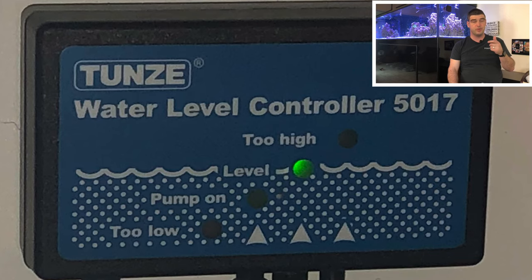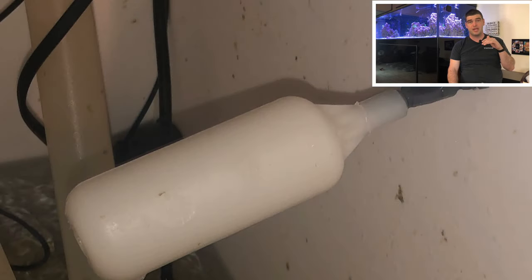I do use a manual float valve backup. This is absolutely a requirement in my opinion if you're going to hook your fish tank up to a limitless source of fresh water. It's nice to have a couple layers of redundancy. Also, when my refrigerator leaks, my wife doesn't divorce me because I've ruined her floors. As you can tell, I've put tile down on the floor here — you don't want to get hundreds of gallons of water on your floors.